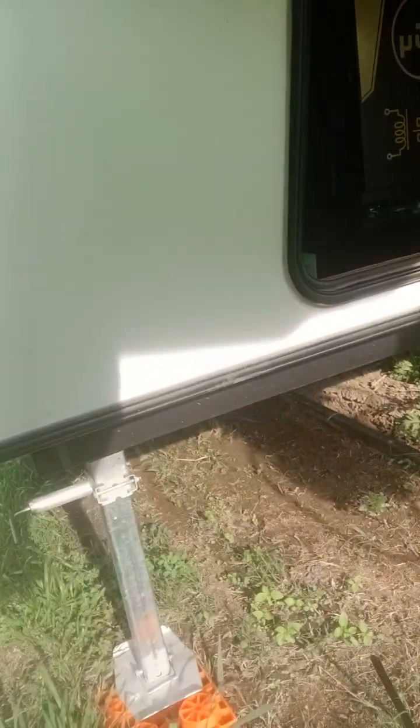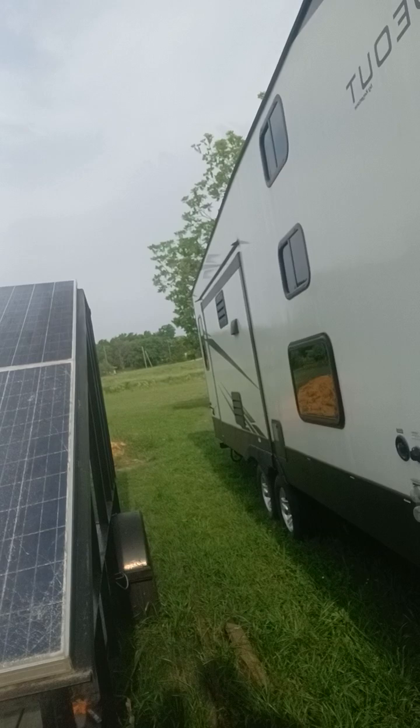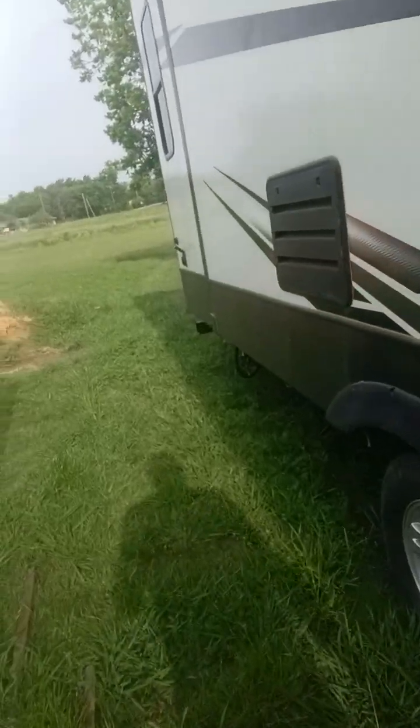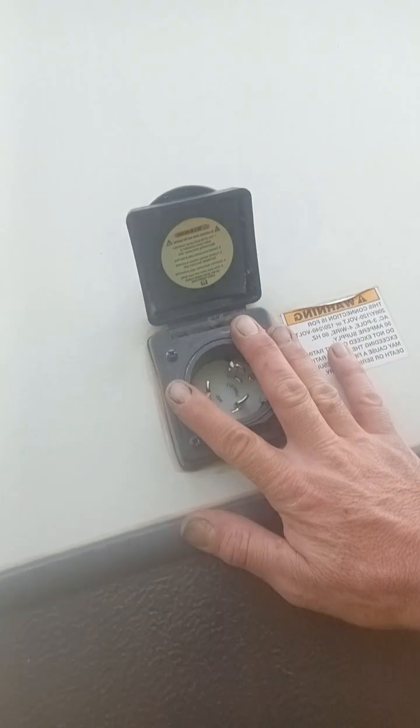So this setup will be set up. No, sorry for the redundancy. As you can see, it's a pretty long RV here. So underneath here is an I-beam stretching from point A to point B. We'll be running Schedule 40 conduit, inch and a quarter, coming up with an elbow into a junction box underneath here, mounted right here. And that junction box will come in with some flex tube coming into this circuit.